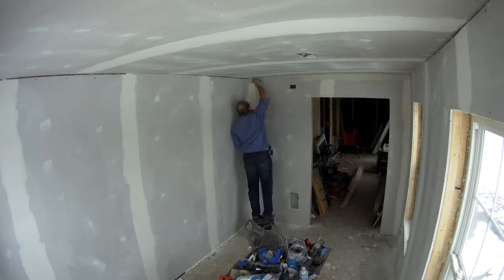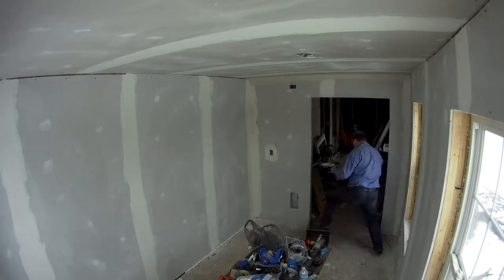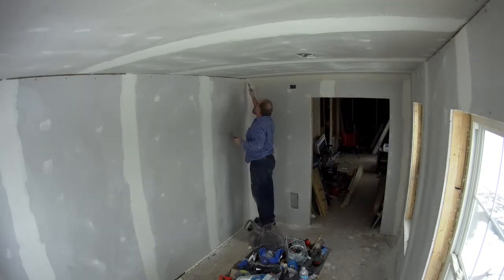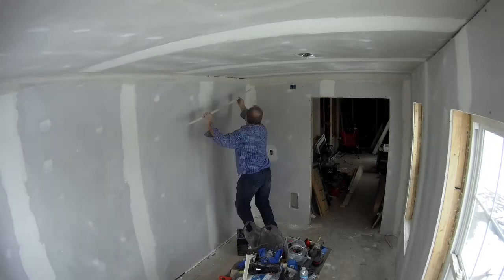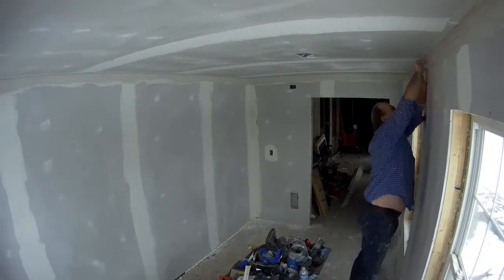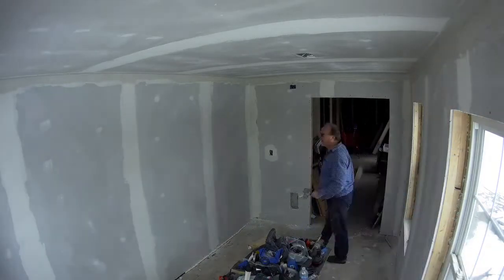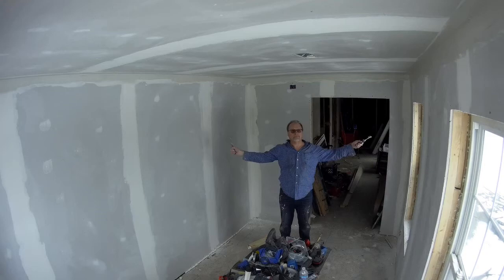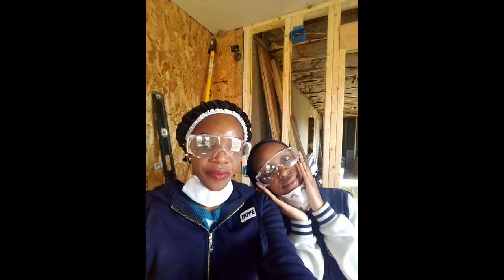Here are the ceiling corners going in. Like I said, I'm using those 90-degree steel corners with formed paper tape on them — they make for really beautiful corners because I can't use the paper tape stuff. They're easy to use. If you've ever done drywall, you might want to consider spending a little extra money on them. For the home gamer, they make for nice quality results where paper tape is a headache. Anyway, thank you for watching — this is only part one of several parts. Next is paint. Here's my crew — very proud of them.